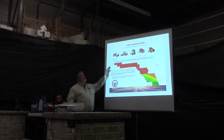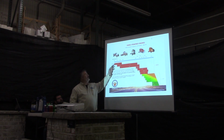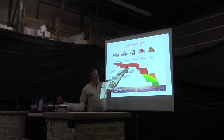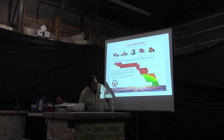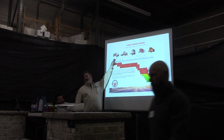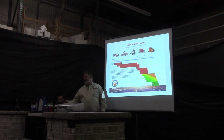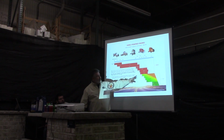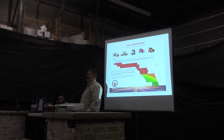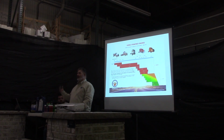The first ones came out with, well, we'll just stick with diesel oil. The first one came out in 1940. It was a CA. Then every year, as they improved or they needed better requirements for oil, they came out with a different, you get your CD oils, your CIs, CGs, down the line. Now, I could always use this oil here for this machine back here. If I wanted to put it in my old Model A, it was fine. You can still do that with the CK4 oils, but you can't do it with the FA oil. The FA oil is not backwards compatible. Just something to know down the line.